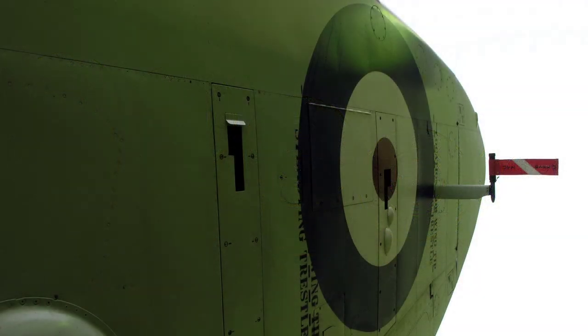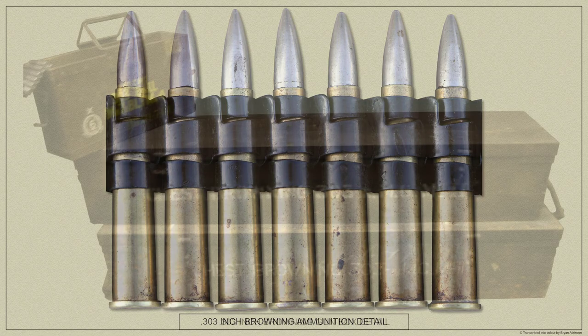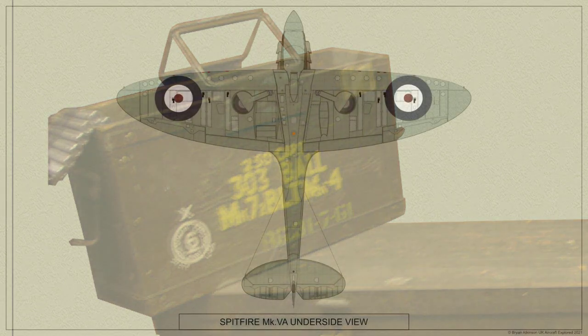When fed to the gun, the belts become disintegrated as rounds are withdrawn and the links are thrown out of the gun to fall through the openings on the underside of the Spitfire's main plane. The links are finished with a protective coating and when issued are free from oil and ready for use. When belts are issued, factory filled in boxes, the following precautions must be observed.